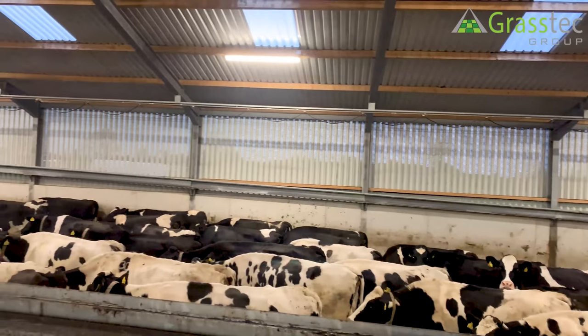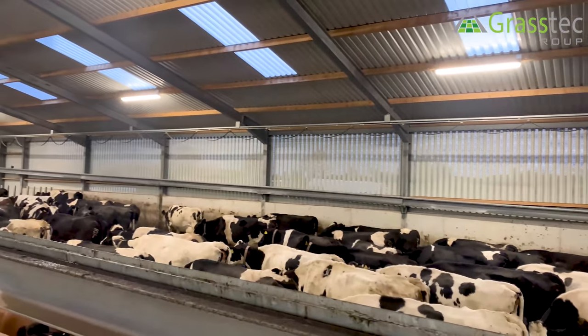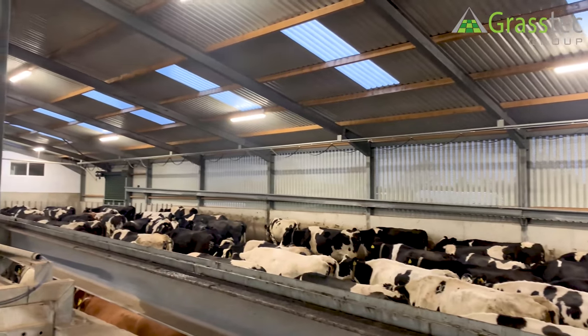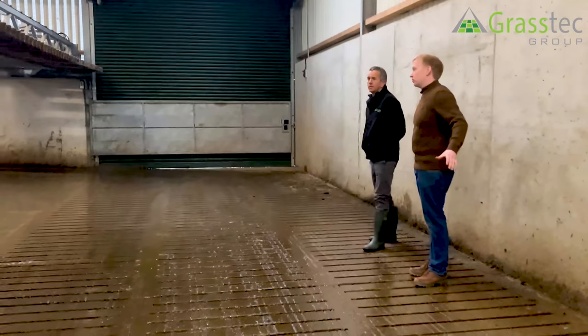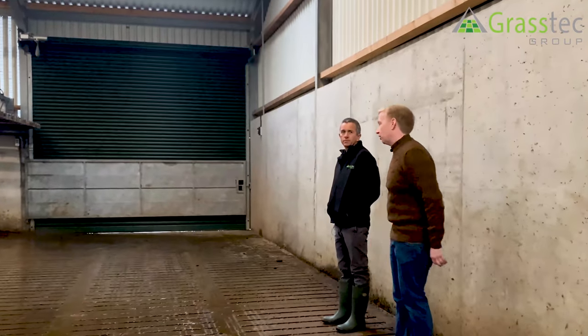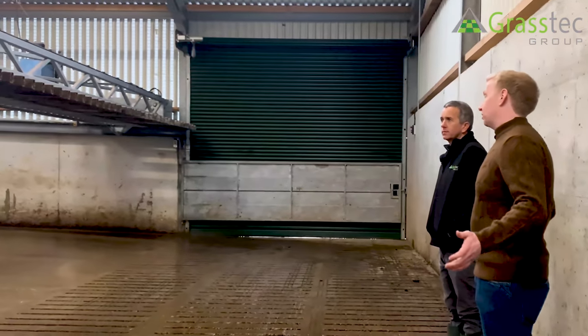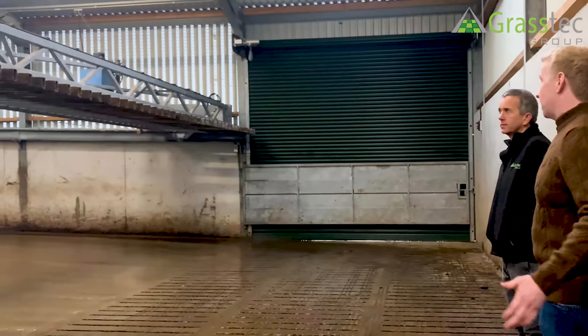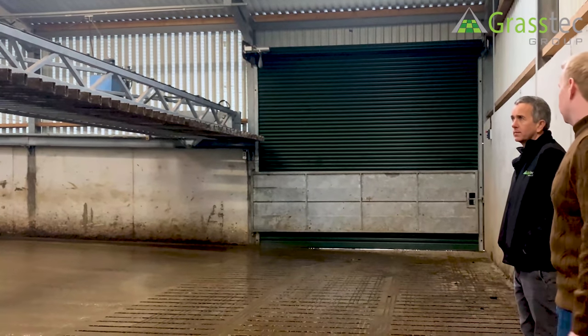I see your backing gate is not coming to this end wall here, it's coming to the first column here? I'm coming to the first column because with the backing gate, really what you're wanting the cows to do — you don't need the backing gate really for the first hundred cows because they're eager to get onto the rotary. It's only the last 50, 60, but once they come in and under, we can drop the gate down and bring them all up with the auto advance function.